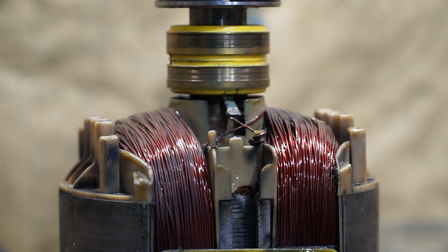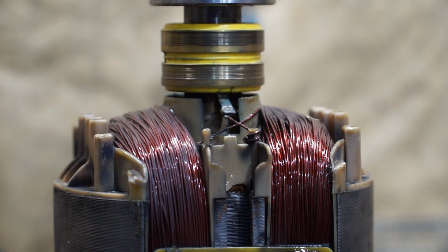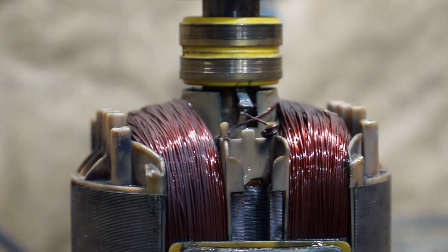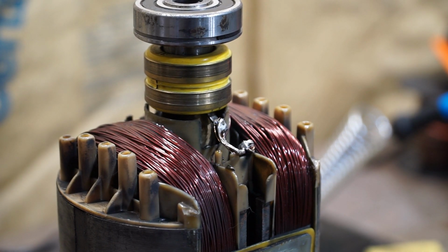Half the coil, or that one side of the coil that attaches to one of the slip rings, has come loose. Just broke off. And now I'm really wondering if I can fix that. So there have been two developments since last night. One, the new rotor doesn't fit, so I'm returning it because the place I bought it from advertised it improperly. And two, I've been forced to fix this one.